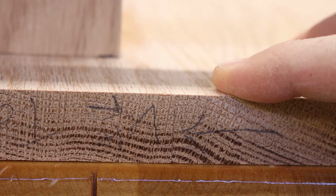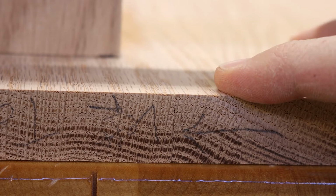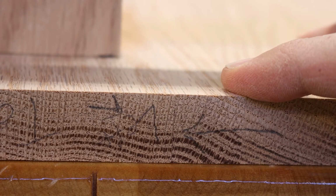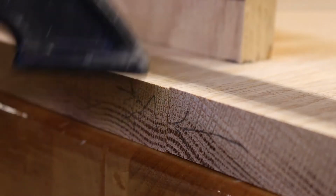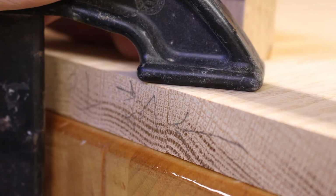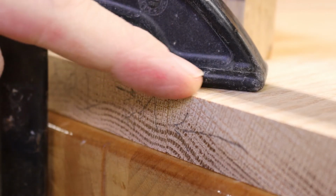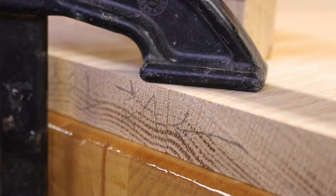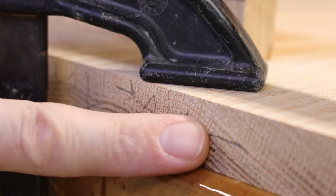Now, before I attach anything or lay anything out, I want to make sure that I have a flush surface where my pieces come together. If there's any irregularities in your workbench, it might cause one of the pieces to move. So I'm going to apply a hand clamp to the seam so that I know my top surface is going to be flush. I also need to check and make sure that my end is perfectly flush.